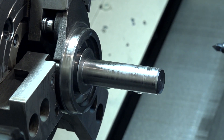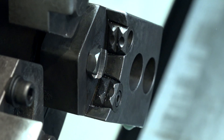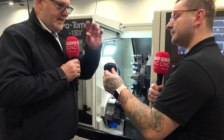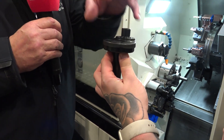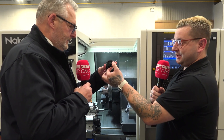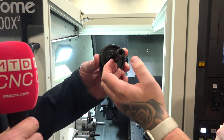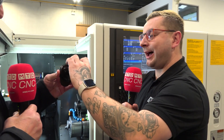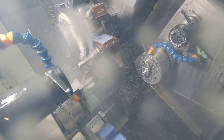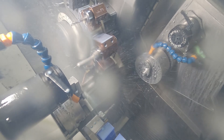Inside the jaws, each jaw has two tooth inserts that are independent and rock slightly. Because of the inconsistencies around the castings, that slight rocking motion within the teeth allows them to clamp with six points of contact evenly every time. There were further challenges too — a groove that requires getting right down near the spigot, with the spigot itself in the way.